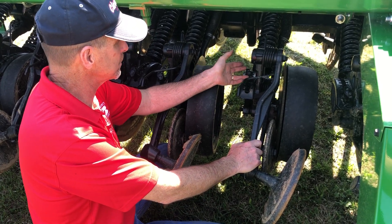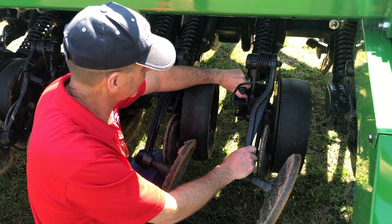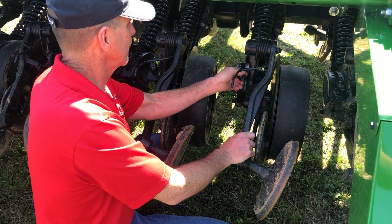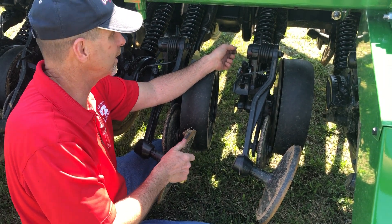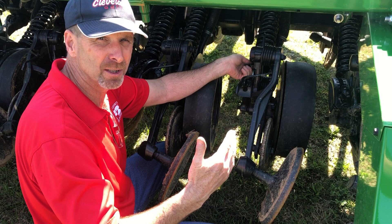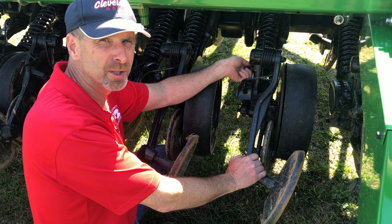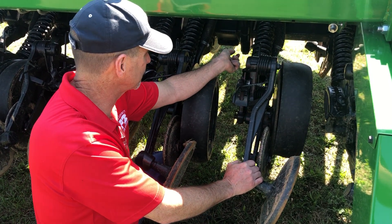In terms of depth adjustment, it's accomplished by pulling up on the T-handle and moving it up or down in the quadrant. If we're drilling early in the spring and doing nothing but forage seedings, we're almost always going to be in the back setting on the depth quadrant, which is the most shallow setting. Even for soybeans, about four notches up would probably be the deepest you would go, and oftentimes not even that deep. Go ahead and do a test section in the field, dig a few seeds up, and make sure the seed depth is where you want it before you really get started with your drilling operation. All the way back is shallow; all the way up is the deepest possible position.